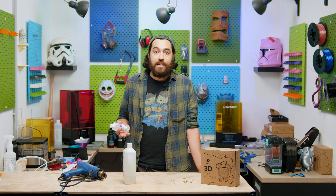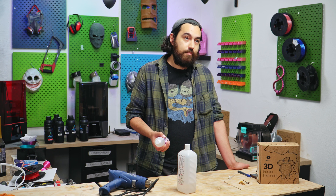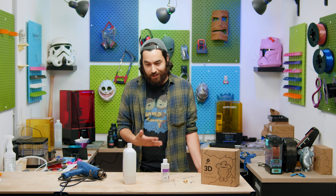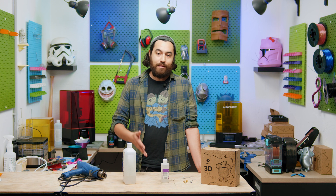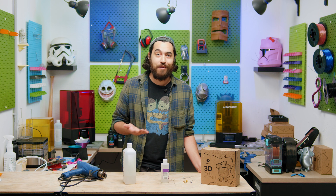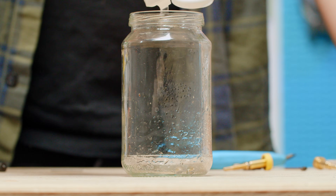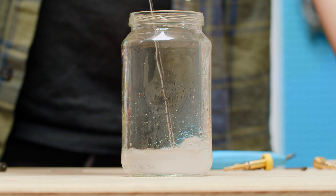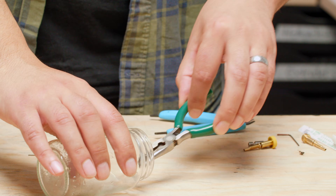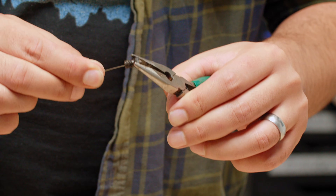Using ethyl acetate isn't always straightforward — some PLA dissolves better in acetone and some better in ethyl acetate. Search online to see if someone has done this with your particular brand of filament; chances are someone has. For nylon, it's trickier — nylon is quite resistant to solvents. You could use formic acid or sulfuric acid, but these tend to corrode the metal the nozzle is made from. After immersing your nozzle in solvent for a day or two, pick at the back with the needle, let the solvent evaporate, reinstall, heat up, and push filament through.